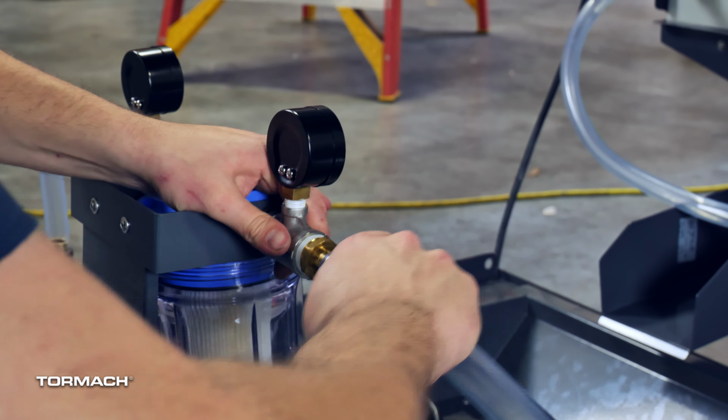Plug the power cable from the flood coolant pump into the flood coolant power outlet on the side of the electrical cabinet. After setting up the flood coolant kit, add water and coolant to the tank at the appropriate mixture. Then test the enclosure for coolant leaks. If you find any, wipe off the coolant, clean with denatured alcohol, then wipe it completely dry. Seal this with Sikaflex. If you don't get all the coolant off of the enclosure, the Sikaflex won't seal properly.